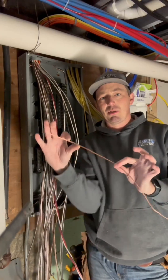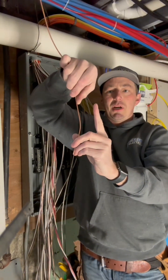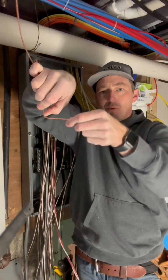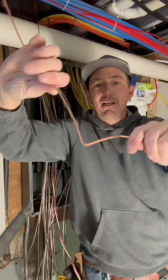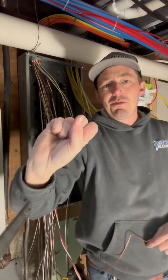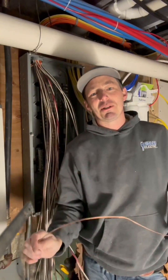I get asked a lot how do you turn those perfect 90s with your pieces of wire, so I'll give you a little demonstration. You get that down to where it's going, and then wherever that screw is — say that screw is right here — I just put my finger right where that screw is and then I just crank it around my thumb. Notice how my thumb never moved. It's not a perfect 90, but you see how you get that nice turn right in there. You do want to have a little bit of nail — if you don't, your thumb's going to be sore by the end of the day.